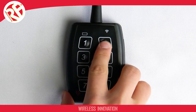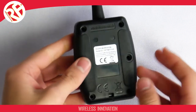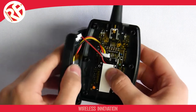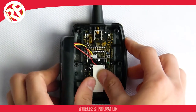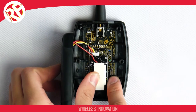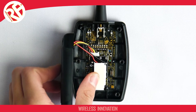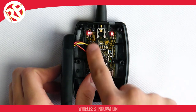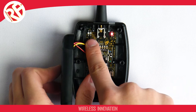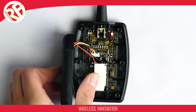To change this mode of operation to a different operating mode, such as LoRa mode 1, you need to first select menu 1. To change the operating mode you always must first select menu 1. To do this, use your set push button located here. These LEDs at the top of the circuit let us know what's going on. When you push the set button, this LED will flash once — this means we are selecting menu 1. Wait for this LED to flash again and now we're in menu 1.